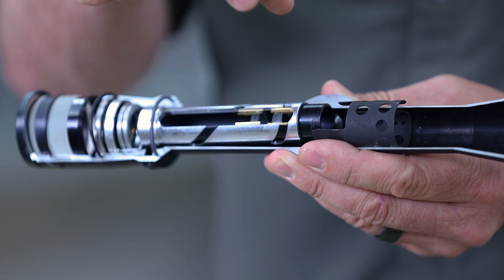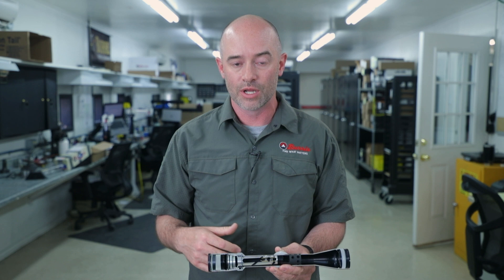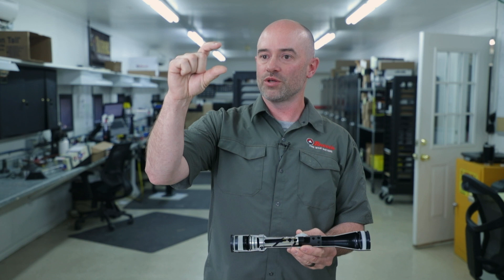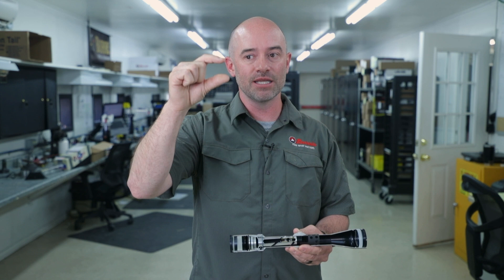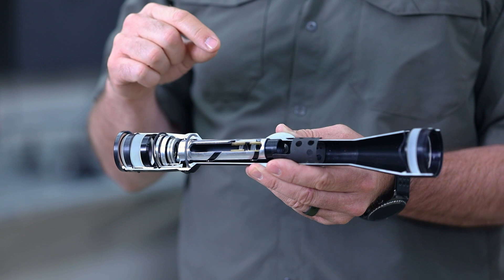It's kind of locked in to the target or whatever you're seeing coming in from downrange. To try to apply that — what's the advantage or disadvantage, and why do people like one versus the other? My easiest exercise is to take two fingers, your thumb and your index finger, and put them so that they are bracketing something on the wall — be it a window, a picture, or a computer monitor — and make sure they match that picture between your fingertips. Now, this is a rear focal plane reticle and it can't change size. So if I zoom in and out by bringing my fingers closer or farther away from my eye, I can see that they don't match that object anymore — they don't match the monitor or the window or the picture frame. That's the same thing that happens in this scope. A rear focal plane reticle is only one size, so when you zoom in and out it doesn't always stay in exactly the same proportion to what's coming through the front.